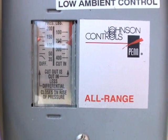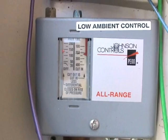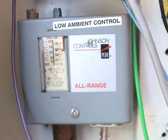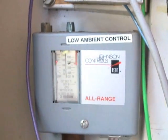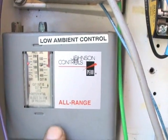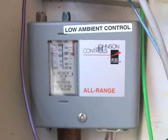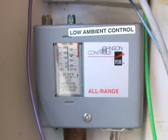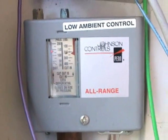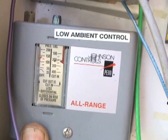I have this set up so that it'll run at about 225 — meaning the condensing fan will not cut in until it gets to about 225 PSIG, and this is R-22 by the way. In a commercial application such as a school building, you would need this particular fan control because there are times when it's still cool outside but your heat load is so great with all the computers and all the students inside that you'll still need to run the air conditioner. You can't just open up the windows, and a lot of times the windows are all locked up tight, so this allows you to run the air conditioner when it's still rather cool outside.